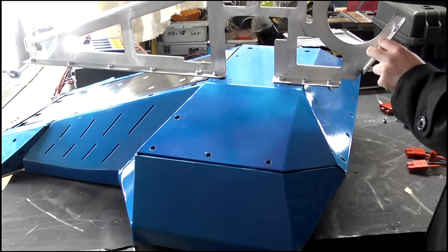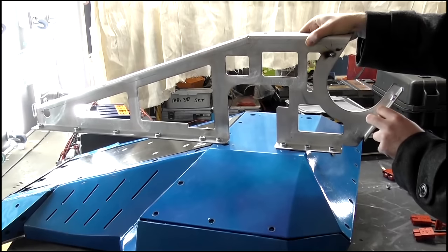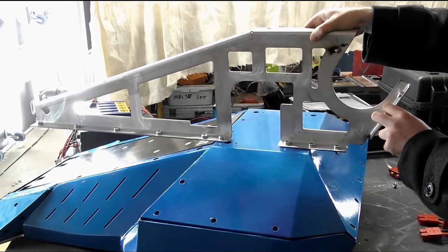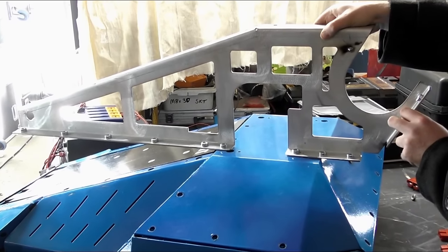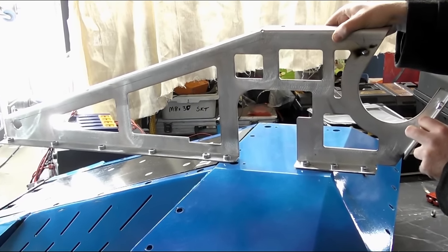The chassis base is 8mm aluminium, while the inner bulkheads are made of 3mm mild steel — here we have a spare one to show you. These make up the main part of the chassis. They're lasered out to make them as light as possible, and are shaped to hold the CO2 bottle at the rear, while at the front there's a hole where the flipper is hinged to.